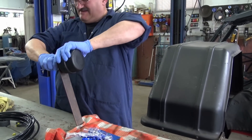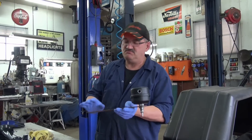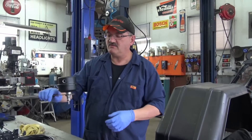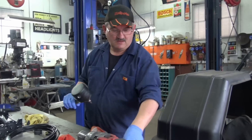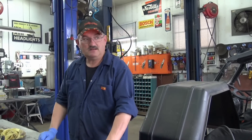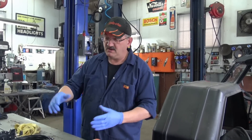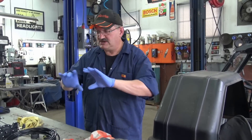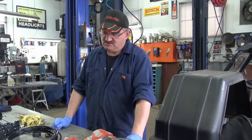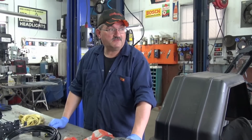I got that kind of tight there now. Anyway, this is threaded and this goes on and then the nut jams on. So this has got to be sandblasted and bent. This is only just a very preliminary starter of the bracket for the - we're replacing the air filter. That one with that one. And I'm going to be putting in an extra air tank. It's going to be a two and a half gallon tank, about 24 inches long, and it's going to go just below the driver's seat on the chassis. It's just going to be an extra holding capacity for the air.